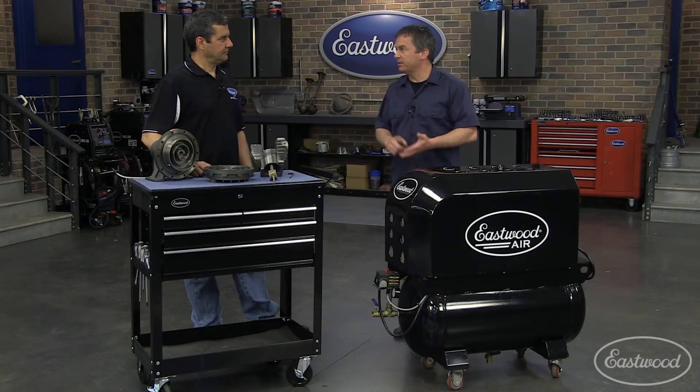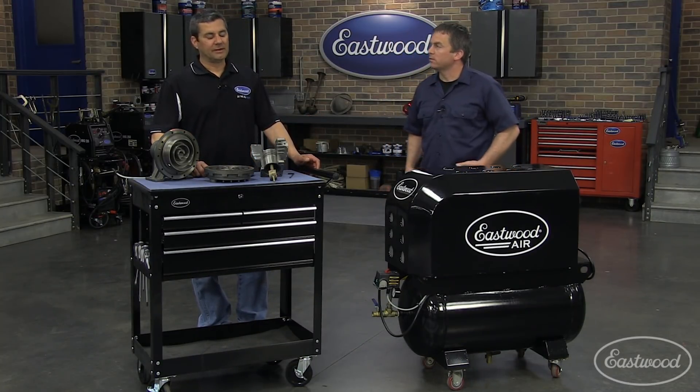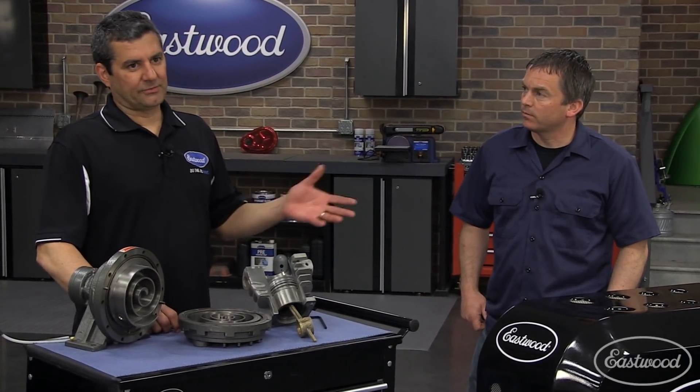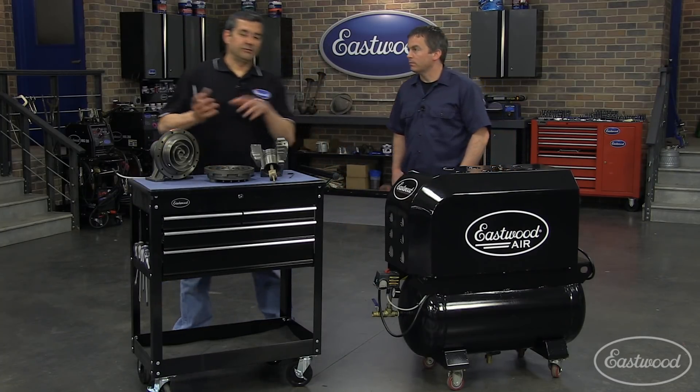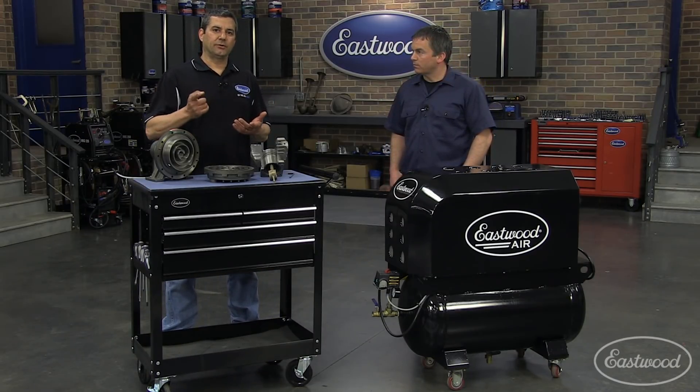So when people are looking to buy a compressor, you always see PSI and CFM ratings. What exactly does that mean, and how does this compare to other compressors? CFM is the measurement of a volume of gas — or in this case, compressed air — through an orifice over a set time, which gives you cubic feet per minute. SCFM, which you'll also see out there, is a standardized measurement. It takes that same measurement but standardizes it to one atmosphere, or 14.7 PSI at 68 degrees F. So essentially that gives a level playing field — a compressor manufacturer in Florida and one in Denver, if they use SCFM, they're going to be standardized. The second part is where you measure this from — you can measure your SCFM from the compressor inlet side or the exhaust side, out of your tank. What we're doing is measuring out of the tank, because that's where you're going to be using the air from.